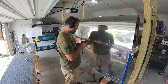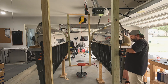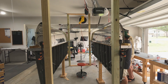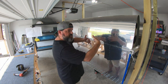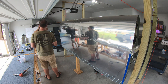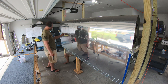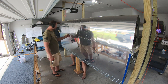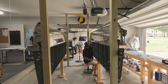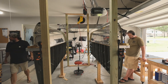It's funny — when I'm riveting by myself, controlling the bucking bar seems easier than riveting with a buddy. I think it's because of a clamping sort of action between my two hands coming together, and it's hard to duplicate that balance when I'm only bucking and don't have an opposing force. The bucking bar really does bounce a little, which is why there were a couple I had to drill out — at the last moment as the pressure ramped up it would bounce, walk off the rivet head, and smear it.